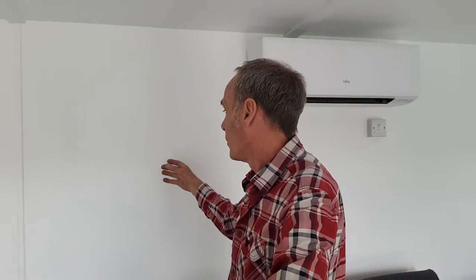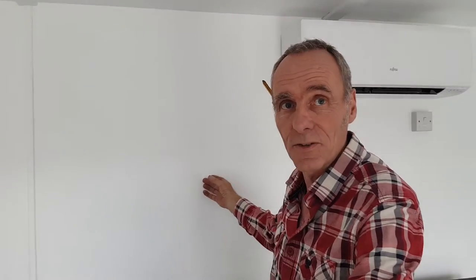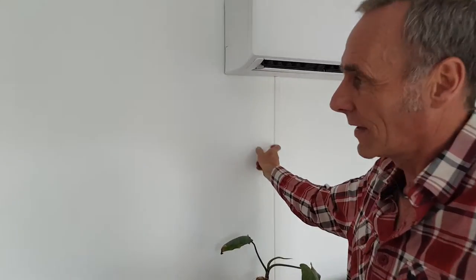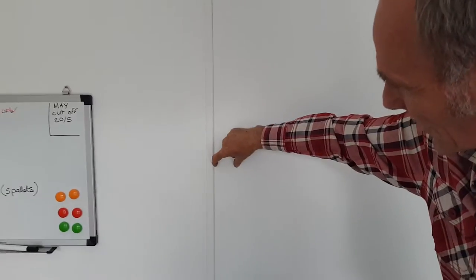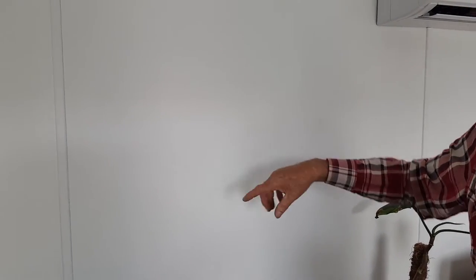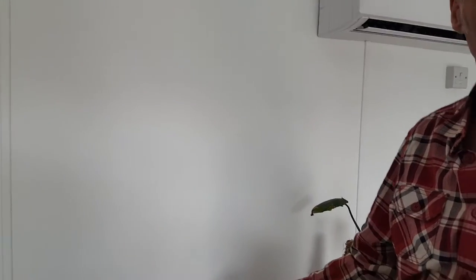I'm here with Alex, he's going to show me how to put something heavy on a studio interior wall. The wall is basically full of insulation, because if we fill that with timber we create thermal bridging. So behind that main panel is insulation. There's a piece of 45mm timber here, and then we've got a box section here, and that allows us to put electrics in safely.